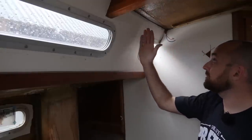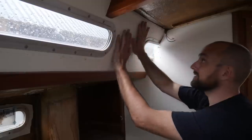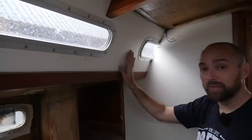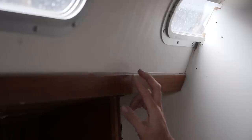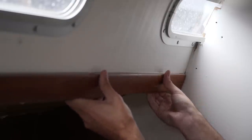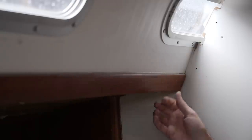The bulkhead is going to get moved forward to right around here and what you're seeing up here is a piece of plywood that's kind of loosely glued to the side of the cabin top just as a piece of trim. For me to tab the new bulkhead to the cabin top I'm going to have to cut a strip out of this, which of course also means cutting this piece of teak trim. Ideally I would want to reuse it but let's give it a go.